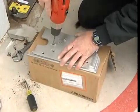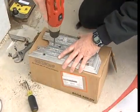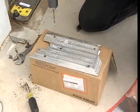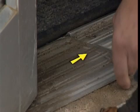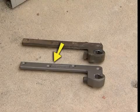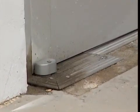The threshold will be modified to accommodate the 27's 4 adjustment holes. Typically, only the closer body requires replacement. At this installation, however, we notice scoring on the threshold. Since this was probably caused by arm screws, we brought an arm as well. The pivots seemed to be in excellent shape. There were no gaps at the underside of the door.